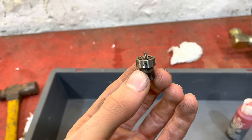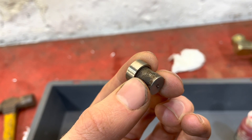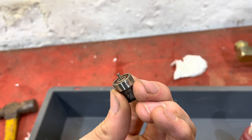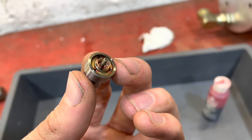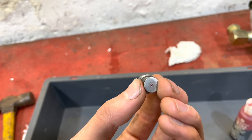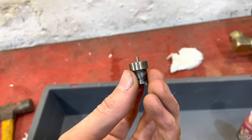Here's a closer look at the nozzle with the needle installed - you can see it's protruding there. The workshop manual says to use diesel when you reassemble it, but I've got assembly lube which is obviously a lot thicker. I think it'll be okay to use it - it'll get washed through after the engine's run for a short period.